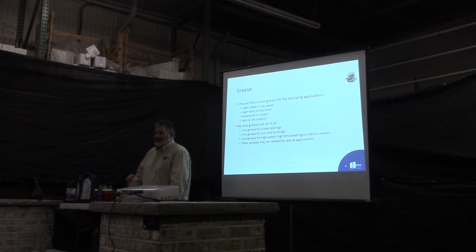Now back in, let's say 1960, 1970, a lot of people would say, well, I've used this oil forever and I've never had a problem. I switched over to this detergent oil and I had issues. Well, that's because the oil they were using before was non-detergent and their engine was full of gunk. They put the detergent oil in, flushed everything out, and then they started having issues. So that's why it's always important to use a quality oil and keep your oil changes up.